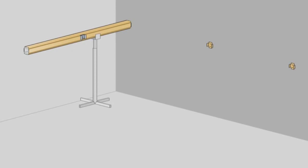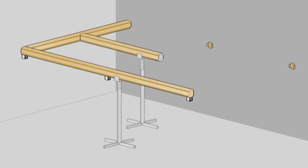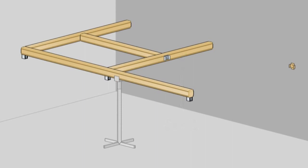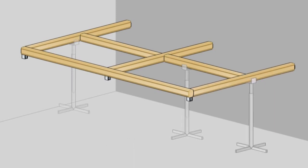Intermediate beams and purlins. If intermediate beams and purlins are required, they are fitted at this stage by working progressively along the Outback. Slide the first purlin onto the beam to beam bracket at the end fascia beam, supporting the other end on a construction prop, and fasten using two 10x16 hex head screws either side. Slide the first intermediate beam onto the beam to beam bracket at the front fascia beam. If required, slide the end of the purlin onto the bracket on the intermediate beam. Lift the beam into the wall or suspension bracket and secure all connections using two 10x16 hex head screws either side. Continue this process until all intermediate beams and purlins are assembled.